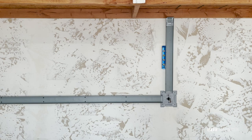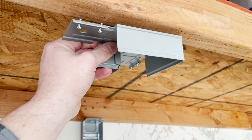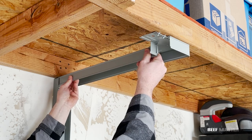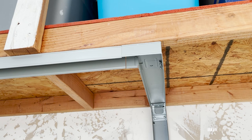Everything was set so I'm ready to run the track across the bottom of the shelves. I was originally going to run the conduit track on the back against the wall, but then decided to bring it forward and run it across the front of the shelf instead. I later plan on building a workbench and installing lights, so I'll have to lean across the desk if I put it against the wall. These Wire Mold tracks are great because I can run a line anywhere I want. To make the 90 degree turn across the front, I'll need to install this elbow. I'll place it in front of the track and then secure it to the bottom of the shelves using screws. I placed another track on the 90 degree bend and secured that as well.